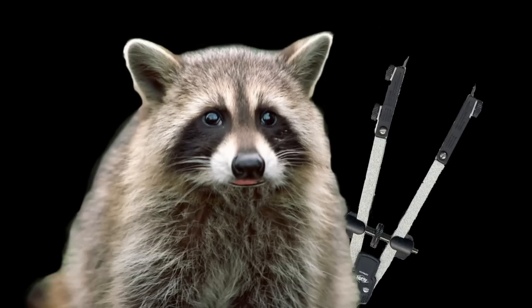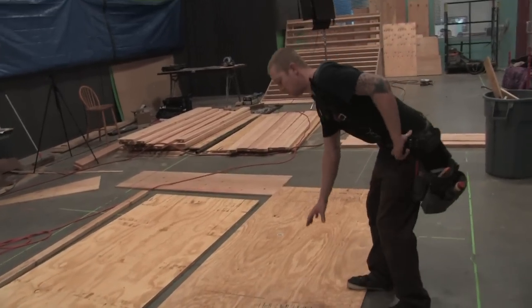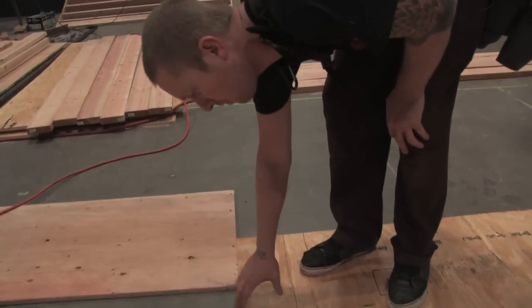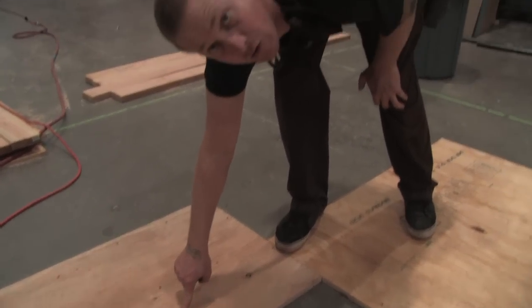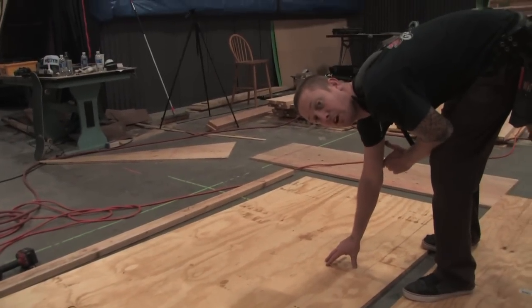Now I'm going to show you how to draw a transition. You remember in school when you pulled out that compass and played around with it on paper? We're going to do a 7 foot 6 inch version of a compass. This is what we're going to use to create our transition. This piece right here is going to actually be the transition. When we take it to 4 — if that's where your ramp is going to be built at 4 foot, that's your stopping point. We're going to have to go to 6, so we're using a scrap piece up here so we can add 2 foot and make our 2 foot extension. This piece right here is where our 2 by 4 is mounted so we can create our compass. Now we're going to put all this stuff together and I'm going to show you where to put your arm so you can swing it and create your transition.